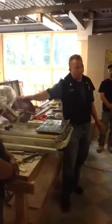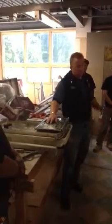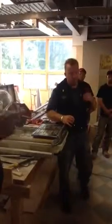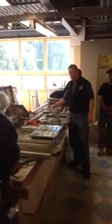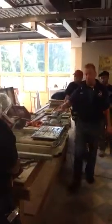Some things to be careful of with this. We have eye protection and flying debris. So we'll have our PPE, safety glasses, and also the noise level. You're going to make sure that you have your ear protection. Dealing with water and electricity, we're going to make sure that we have a GFI. If you don't have a GFI, you should not be operating the saw. Okay, we want to be safe. Keep not only yourself but other co-workers safe.